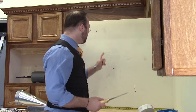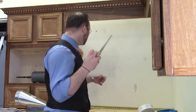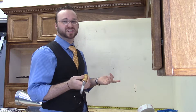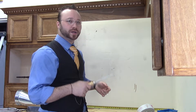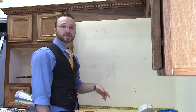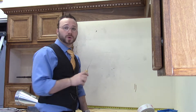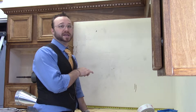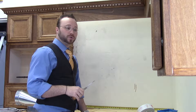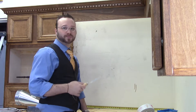I'm going to start by installing a box in this wall. I wish I had something more scientific to do other than just cut until I find the stud I want, but I'm reasonably certain I know where it is. I measured off that wall so there should be a stud there. These are 16 on center, which we know from when we opened up the other wall to put in the venting. Hopefully I can do math — although we're Georgia educated so I'm not holding out. Let's find out though.